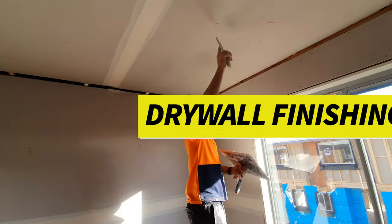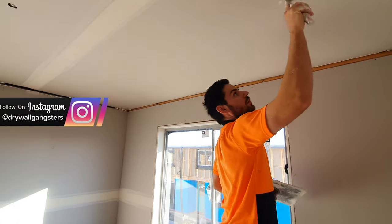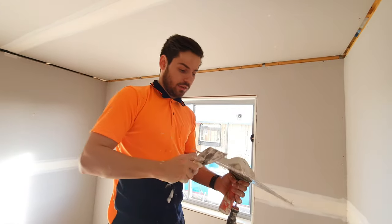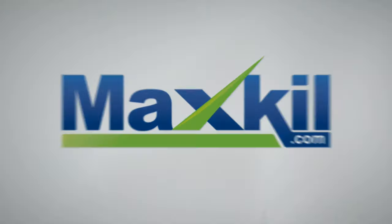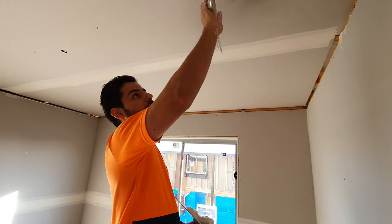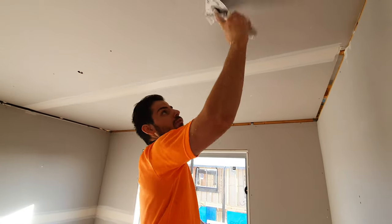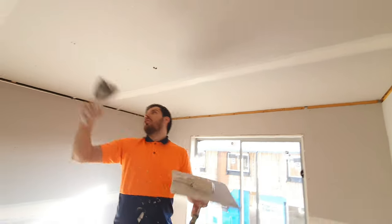To do screws. The reason why I three-swipe is when you've got thick mud and it's based, it doesn't shrink back. Sometimes if you two-swipe, that little bubble there won't shrink back, so you'll later have to scrape that off. Instead, if you just three-swipe, it stops it. You've got it underneath just so you don't have to scrape it.